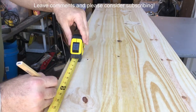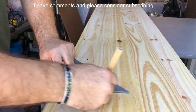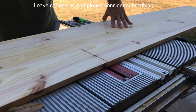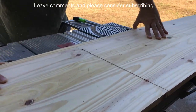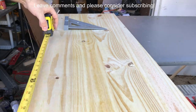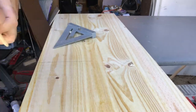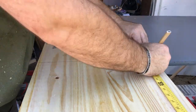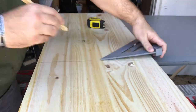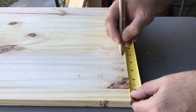This one's 8 feet, and that's just fine. I take that 8-foot board and mark off two sections of 3 feet each for the sides of the rack. I then measure a 5-inch piece and cut it — it's for the top of the rack, the piece that cradles the necks.